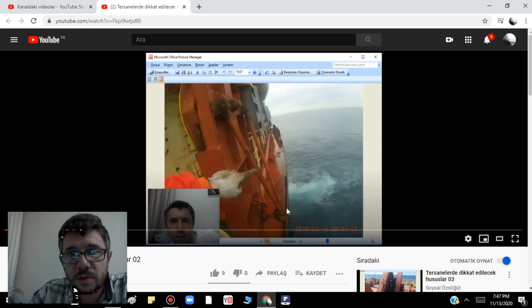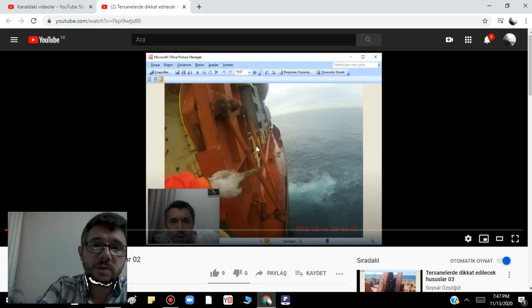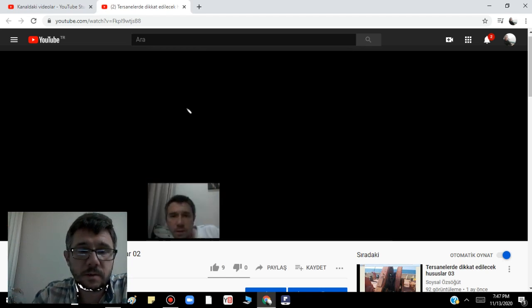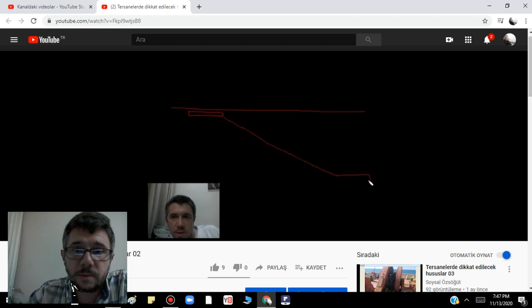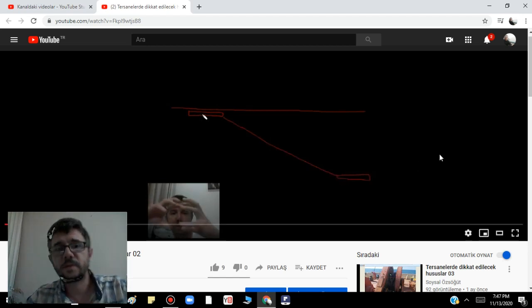This part has to be in very, very good working condition. When you lower, it is supporting the platform here by touching the side of the vessel — it is important. So if any deflection on the upper platform, the back side of the upper platform is bigger than the forward side. If the gap is increasing, most probably your upper platform is wasted. If you take out the upper platform, you will see all the frames becoming very rusty. So your upper platform and your ladder — the upper platform will have some deflection.